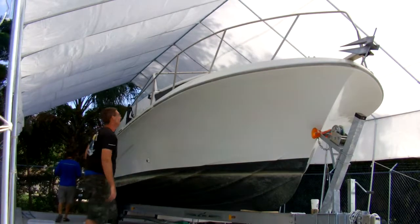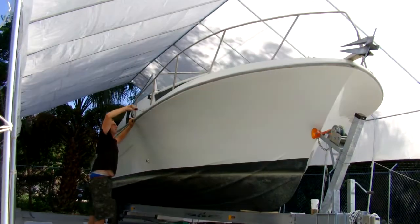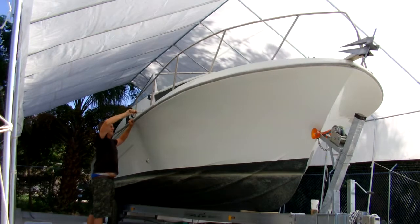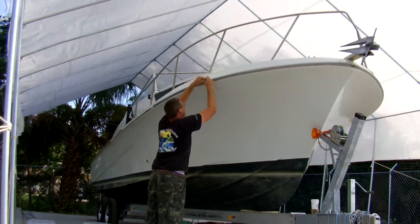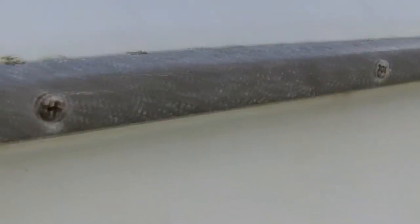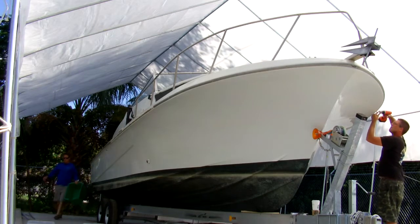The goal is to strip all the external hardware, all the metal, and most of the interior accessories to get this boat down to a bare piece of fiberglass. We're going to start with the most obvious and most external element: the rub rail. Notice how easy it is to remove — that's because the people who assembled this boat cut a lot of corners, including skipping through bolts with nuts and washers. Instead, this rub rail is attached with pointed wood screws. While that makes the original installation easy, it makes the final product very poor. The original rub rail on the Discoverer is a one-and-a-half inch piece of aluminum and is about the cheapest rub rail you can buy.